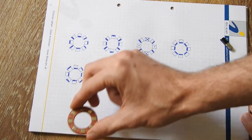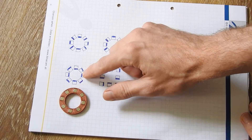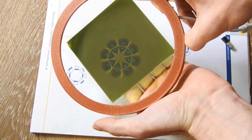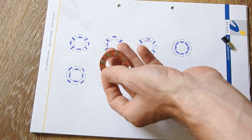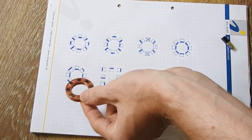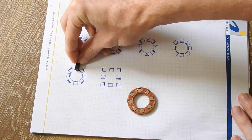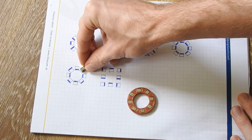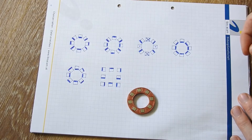The next array has north and south poles always alternating. Viewed under the magnetic field viewer it looks like this — I made a bigger version since I didn't have a smaller one left, but the field looks the same. To make this one, take a magnet, and for the next position just flip it, then flip it again, and so on until you complete the pattern.